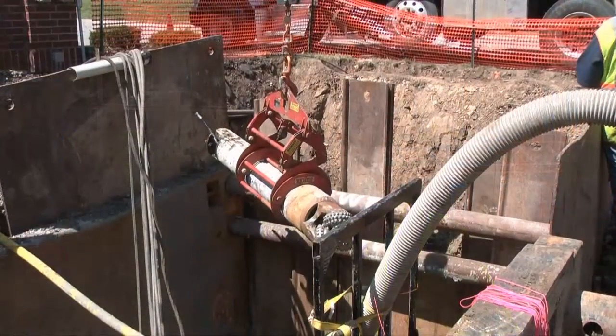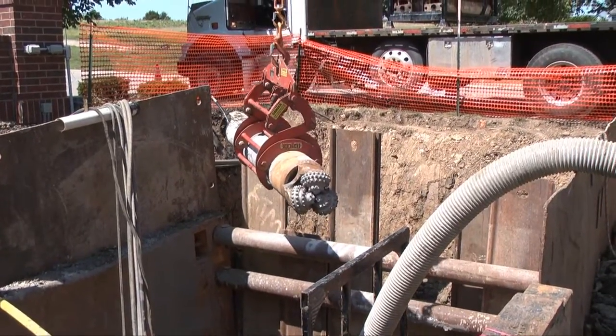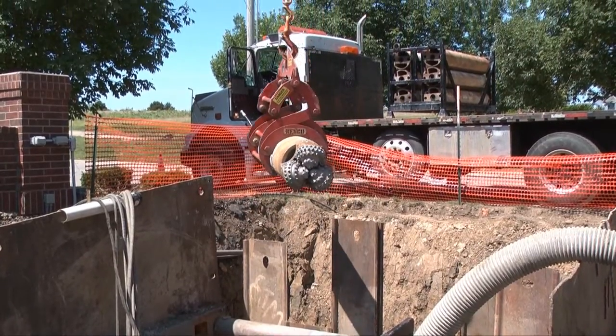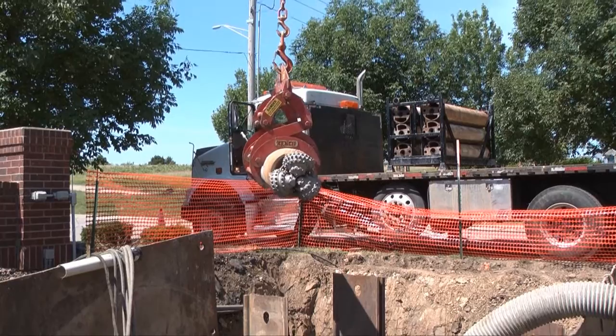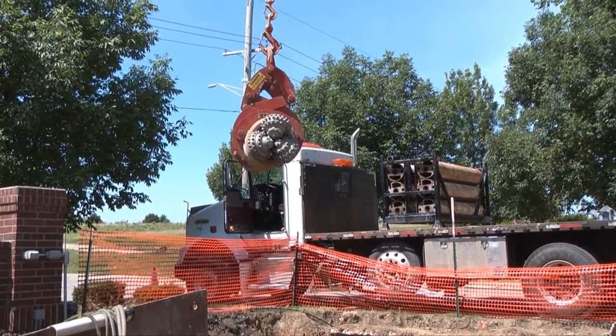It's working out good. We can jump ahead with the access and keep piloting while we have a crew behind us drilling that out to the size it needs to be. It's much more precise and you can tell where you're at all the time. If you're auger boring, there are limited things you can do to find out whether you're on or off, and it's labor intensive. So to know where you're at at all times is key to production.